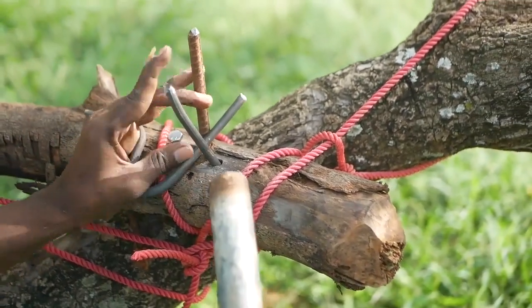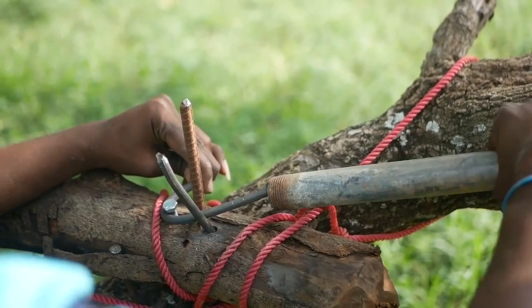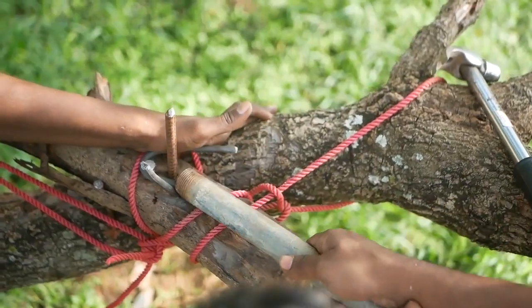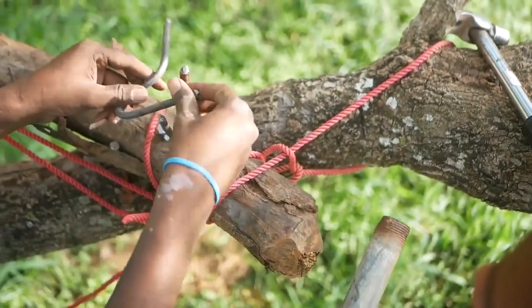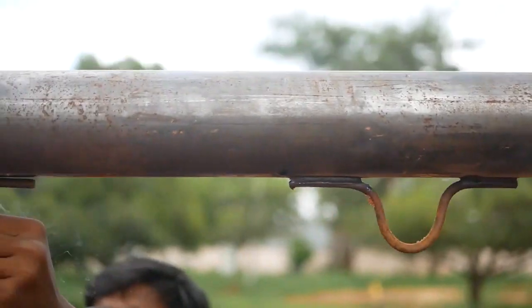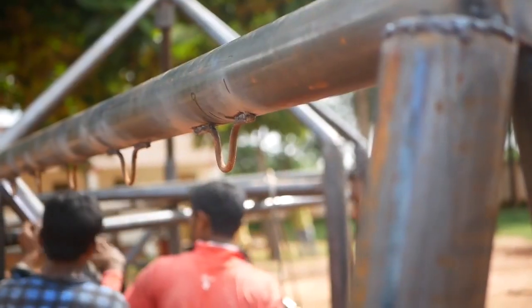The guys here have just made a little makeshift bender. We've got this round bar that we're using to attach our ropes to the frame of this climber. We're just bending this with three points and getting a pipe or something like that to bend them around. Now we're just welding these small saddles onto the climber, and those are just so that the rope can go through there with a nice strong connection.